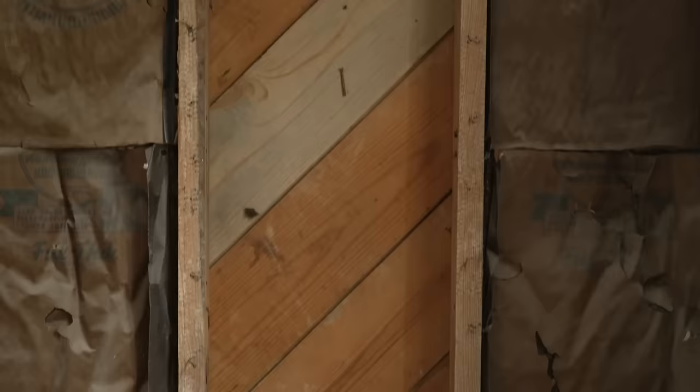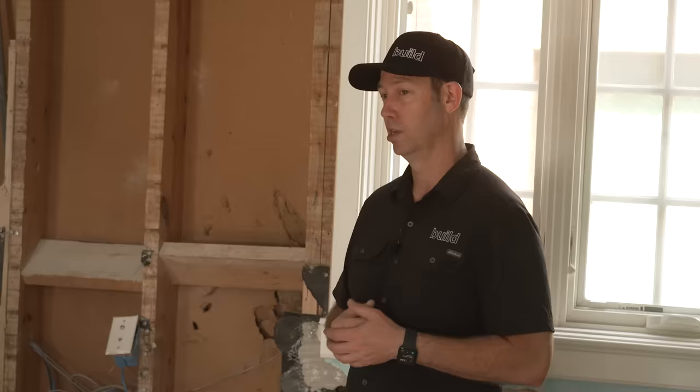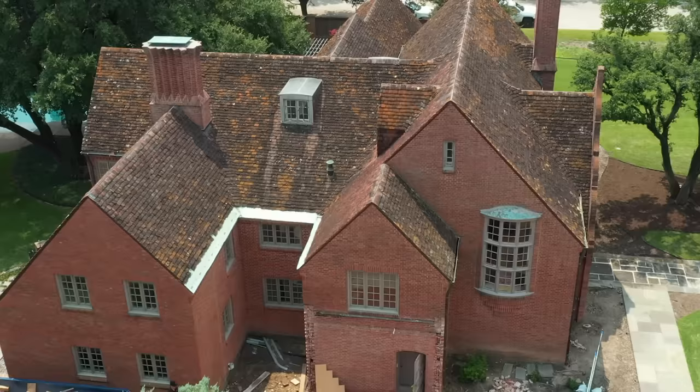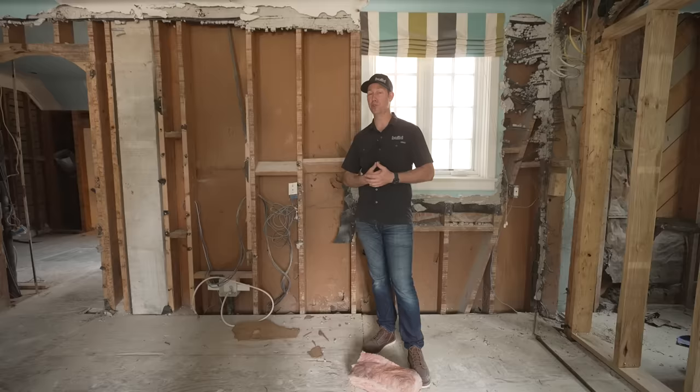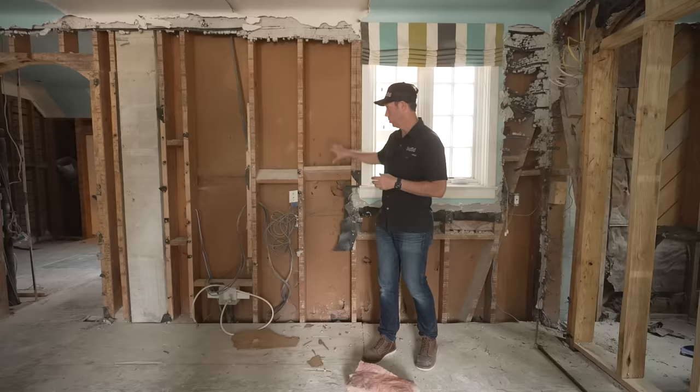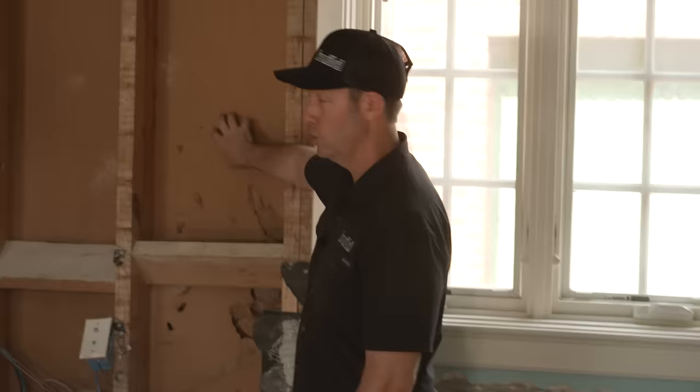I didn't notice this earlier, but if you look into this cavity down at the bottom sill — where the house sits on the foundation and the brick stops — there is a little bit of brown staining. Who knows if it's mold or not, but the point is it's not rotted or punky. It's not happening at all on the plaster or the solid sheathing on the other portion of the house. We need to be really cautious when doing renovations on old houses. This is a pretty historic, gorgeous old house in a historic district.